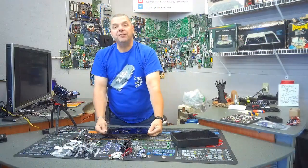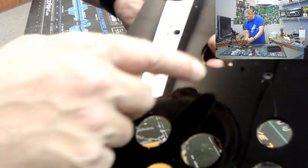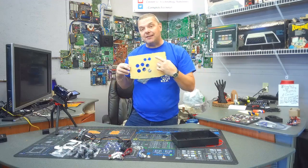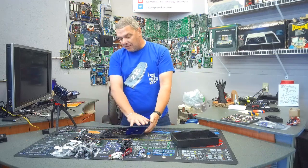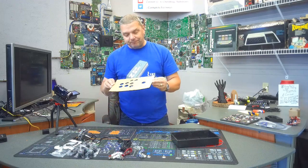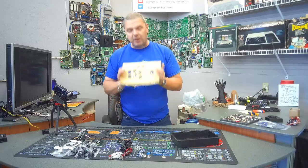So I wanted to show you something that I did. I went ahead and peeled the paper off the top, and I'll show you why. Number one, I think I'm going to leave the black layer on — it just adds a little extra support. And when I opened this up, I noticed it has a hairline crack right here between these two buttons. It doesn't appear to be affecting the rigidity, and I'm going to apply some epoxy to the back to keep it solid. In the interest of keeping the project going, as long as it's solid, I'm planning on skinning this anyway sometime in the future — which means putting on a very thick plastic overlay. That's the reason I peeled this layer off so you could see that crack. This thing is very, very solid, so we're going to go ahead and continue with the build.